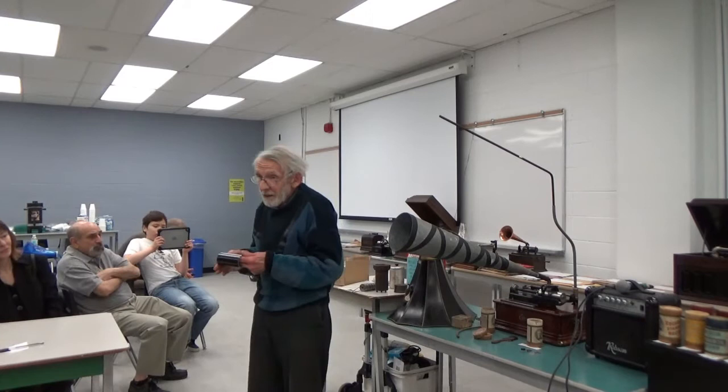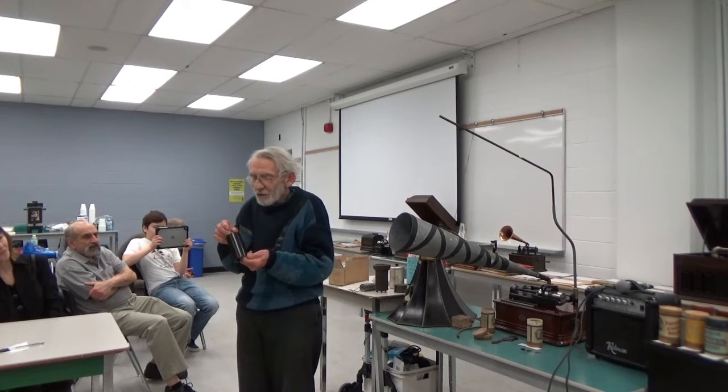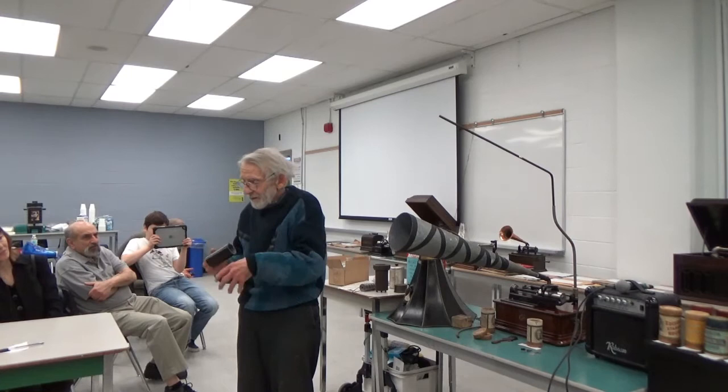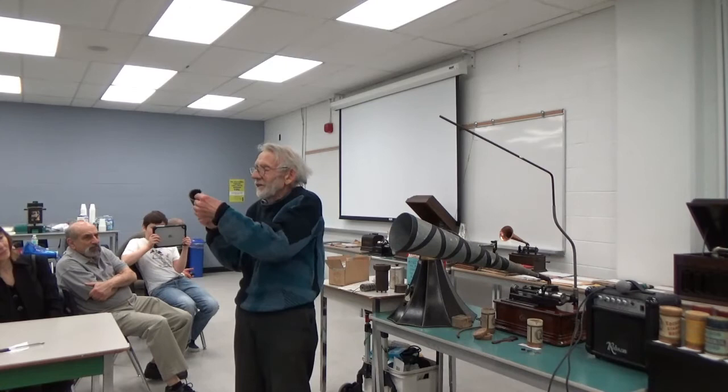It's like the Edison cylinders, you know, they start off flat top and then they get beveled later on. But if you look, I'll leave these out where you can see them. If you look on the inside, you'll see that all I did was wrap the mandrel with, not wax paper, but tin foil. And then I taped it with a piece of Scotch tape. Well, you can see the Scotch tape mark, and it really weakens the cylinder at one point.